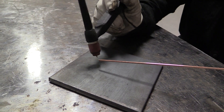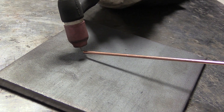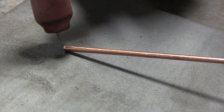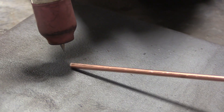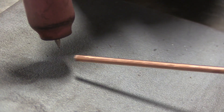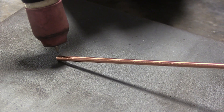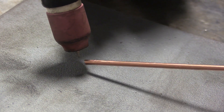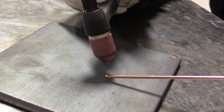It's a bad habit. What you want to do is get your torch set up, angled a little bit in the direction you're going, with it far enough away. The other thing to think about when you're dipping filler is it's not an up-and-down motion. Because if you come in and dip it and pull it straight up, you're always touching that tungsten, which is a problem. So think about rolling the filler in with your fingers and hand — coming in like this instead of up and down. As I move across, I start my pedal, get nice consistency, and just keep dipping that filler all the way across. My torch is moving, my filler is dipping, I'm not touching it. Everything's consistent and it works great.